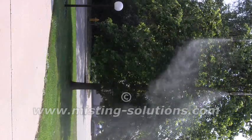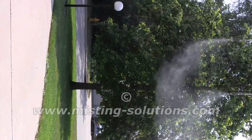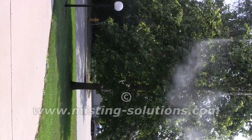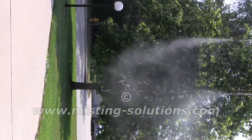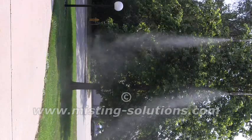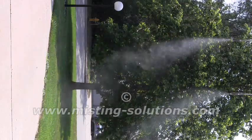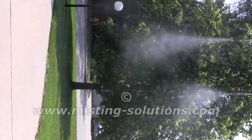You can see that the one on the right, the plume appears right now to be a little bit wider, but that's kind of deceiving just because of the way spray patterns come out at different pressures. They start to normalize themselves at a little bit higher pressures, but it's a good example. So at 250 psi, barely a mist is coming out — we're going to ramp up.